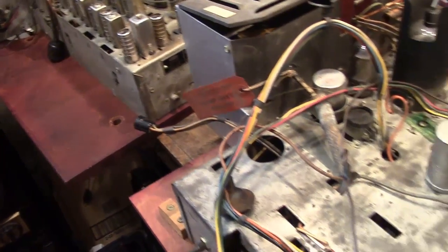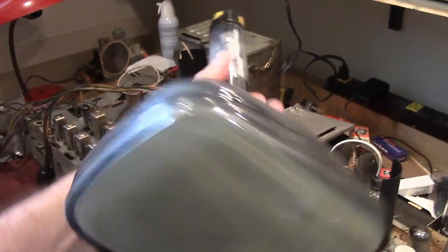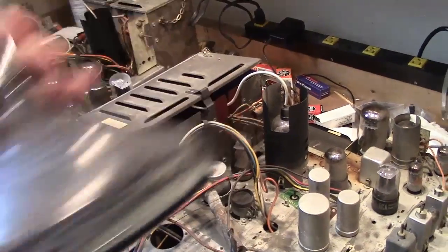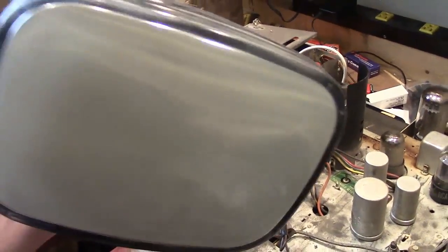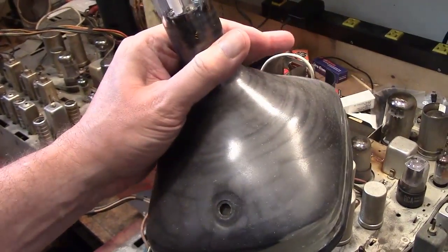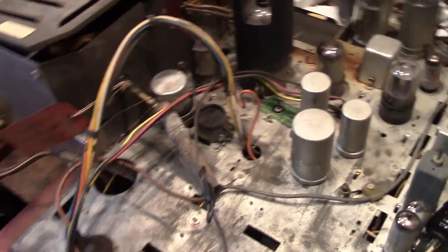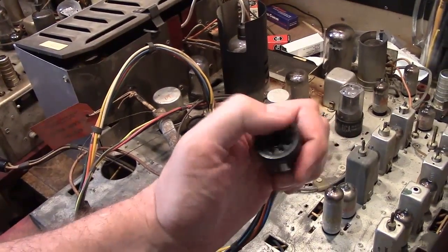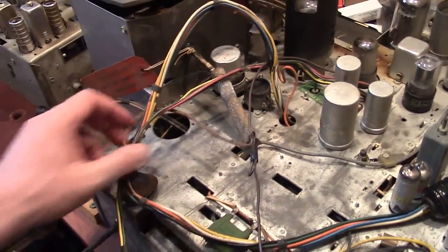So I've got a speaker, but I don't have the yoke or picture tube. Now for the picture tube, that's no problem because I can use this, a little test CRT made specifically in the 50s because more and more sets were made where the picture tube was mounted to the cabinet, and you really don't want to have to take it out if you don't have to. So these little guys, they have the same deflection angle and same voltage characteristics as the full size. And I do have a lot of spare yokes, so I just need to dig one up that's compatible, and I believe it plugs into this. So I'll need to rig up an octal plug with the right hookup for it.